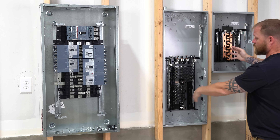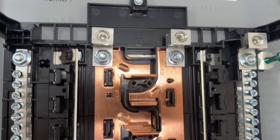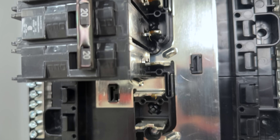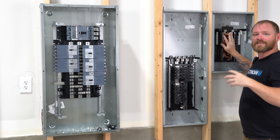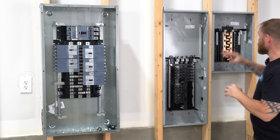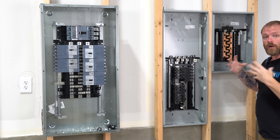The last thing I want to finish on is the difference between these bus bars — these are copper bus bars and these are aluminum bus bars. Generally copper is more expensive, so a panel with copper bus bars costs a little bit more. Copper is about 60% more conductive than aluminum, which is why for a 200 amp service we would feed 2/0 copper but need 4/0 aluminum, because there's more internal resistance in aluminum. There are also thermal properties — because copper has less internal resistance, that lower thermal resistance allows for more current flow without resizing, something you can't do with aluminum. With thermal reactivity, aluminum is also a lot more sensitive to changes in temperature coefficient, so heating and cooling cycles cause aluminum to expand and contract more, whereas copper does not nearly as much.